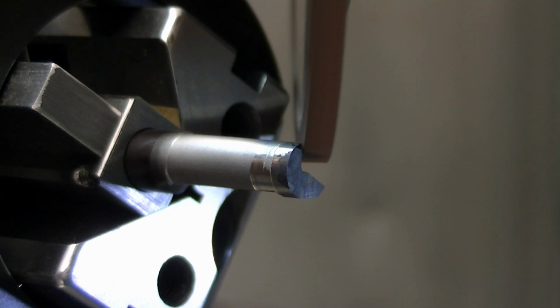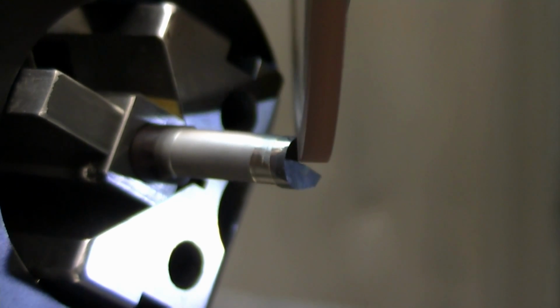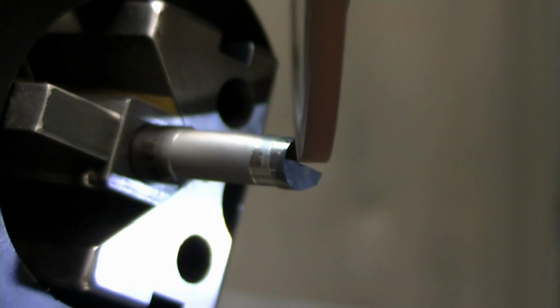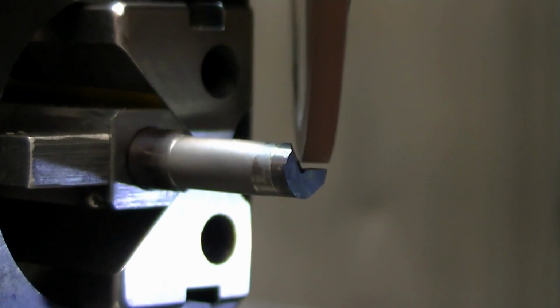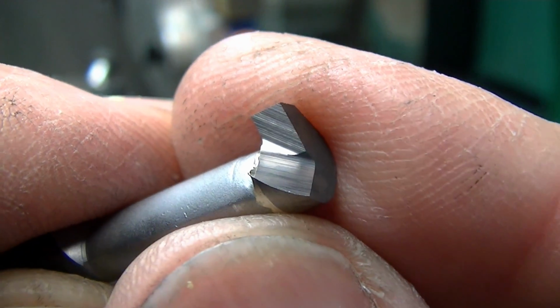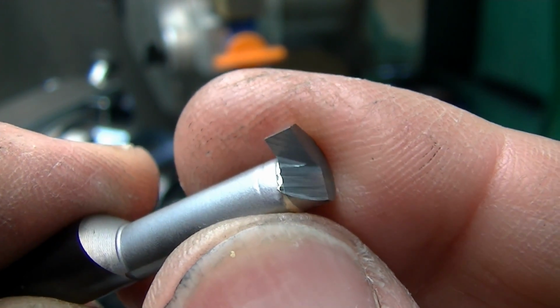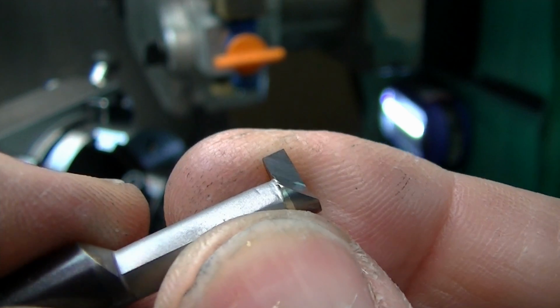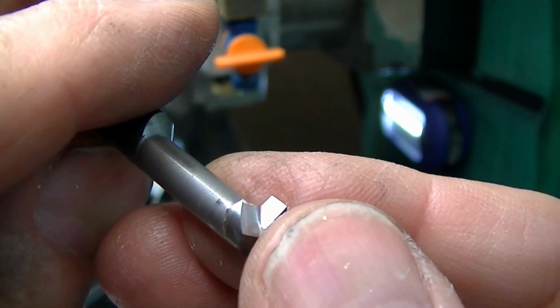Now I'm going to rotate back to the stop. That's it. Here's that gash, and then where I went through 30 degrees off from it and then rolled down into it. That's just to give room for chips to be able to evacuate out this direction.